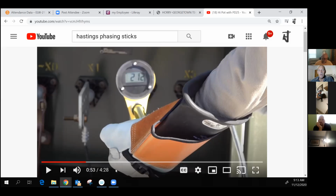He's reading 212 on the meter. Anybody? No. Okay, we've made some three-phase mounts before, and this is a three-phase transformer. And you remember, most of the voltages were either 120/240, 120/208, and 277/480. What do you think is the closest voltage here? 208. Why is it reading 212?